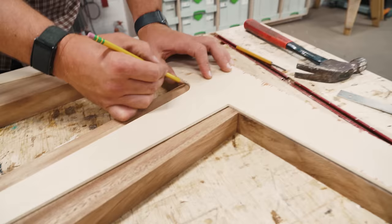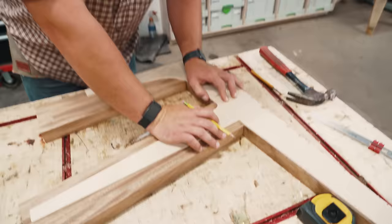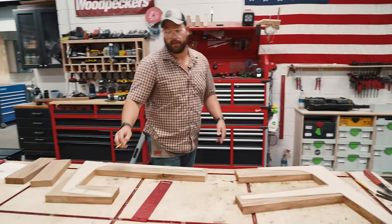This section is brittle. Same concept here — I didn't want to create a weak point in this part of the joint because if I would have left this wider it would have been out to here and this whole part would have been crazy weak. So I tapered it down and now that'll be mitigated. This is the seat and this is the part where all of our weight's going to be held, so better safe than sorry.